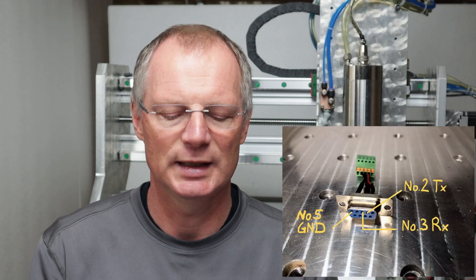The cable is about 10 dollars on Amazon. Next we need an RS-232 to the JMC connector, which is right here, and there are three connections on it: an RX, a TX, and a GND. I'll show you a picture of that and how to hook it up.